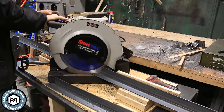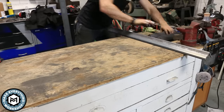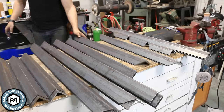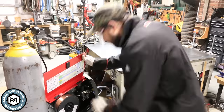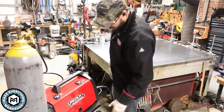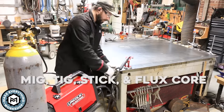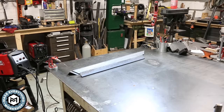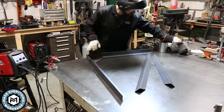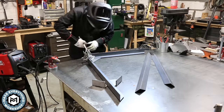If you're doing things that don't have miters and are a little more basic, sometimes you can get a steel supply to cut up the material for you. But in my case it makes sense to invest in a saw like the SteelMax, which is about 400 bucks. For a welder on this project I'm using the new Lincoln MP140. This is a multi-process machine that does MIG, TIG, and stick. It's also super lightweight — under 40 pounds, and it's 110 volts. It's really an awesome machine for anybody starting out that doesn't need crazy thickness capacity in their welds.